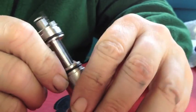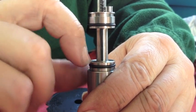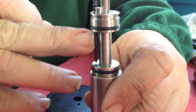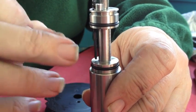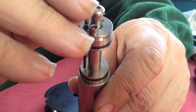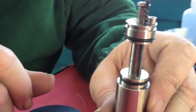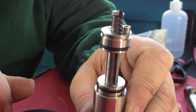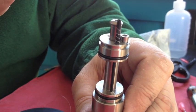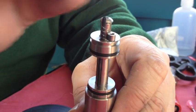Number two: pay close attention down here at the bottom between the mesh and the tank section — those two cannot be touching, nor should this be bent in and touching there. They need to be completely clear of each other, because those are shorts that are going to create a problem for getting a good coil. But that's what is involved in making the coil. Simple, it's straightforward. Just take your time, don't tug on the wire, and it'll guide right around nice and easy.